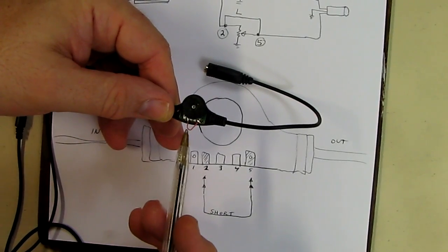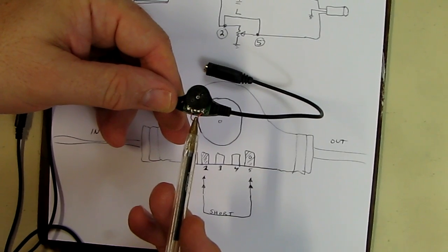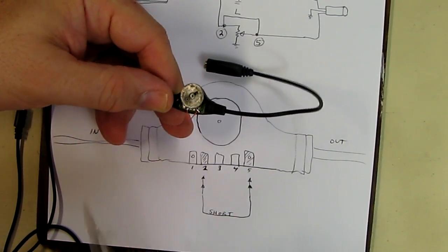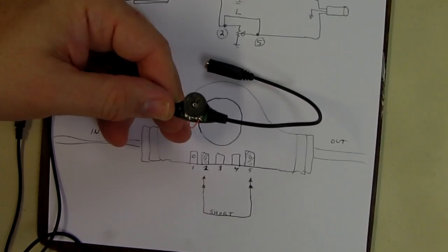After you solder it, you want to use really thin wire and make sure it's got a little insulation on there, and then tuck those wires in. Even if you have to tuck them under the plastic here, just melt some holes or something, and then try to reassemble it carefully. It snaps back together.